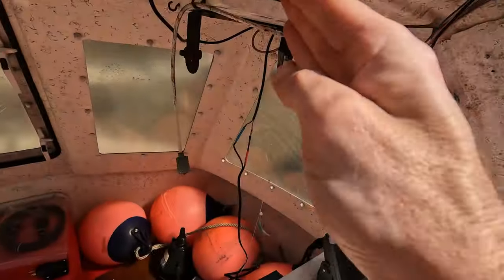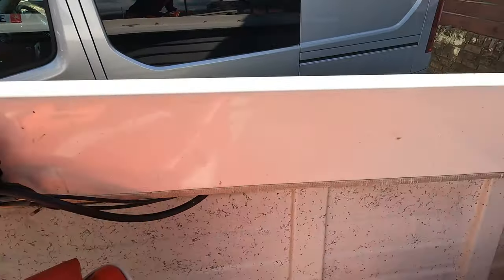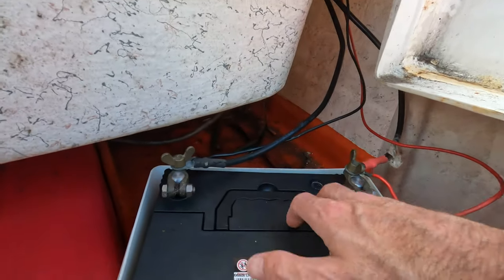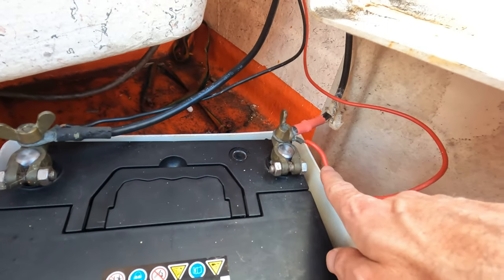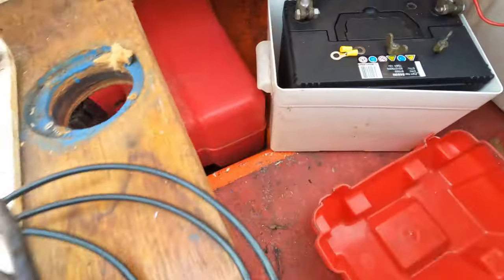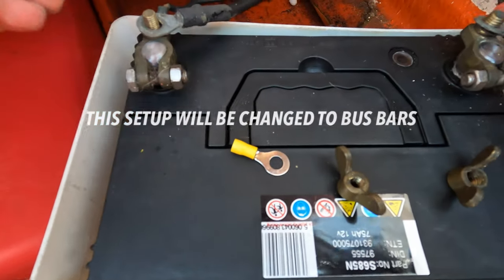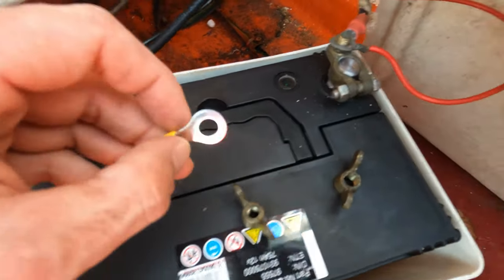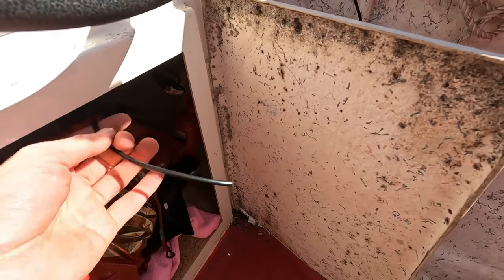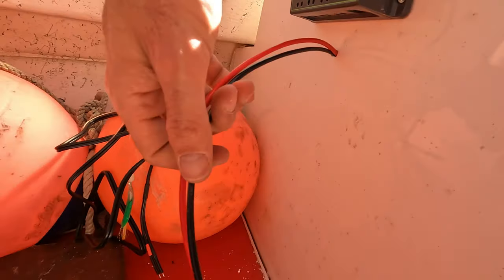Panel's on the roof now and wiring to the controller is done. Here's my conduit of previous wiring which needs redoing - I'm going to redo this entire panel at some point. I'm going to run it along here, as you can see it comes under here, under the seat, and there's my battery. Currently I've got two connections to the battery - I don't recommend having any more than four. I'll put bus bars on this eventually but we'll get into that in another video. I've run the cables through underneath the console - now they're both coming out, positive and negative, ready to do the ends.